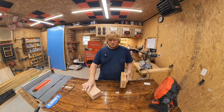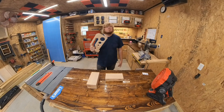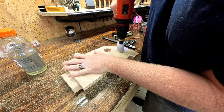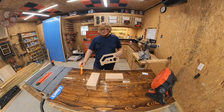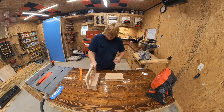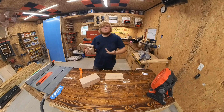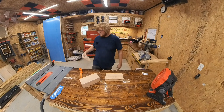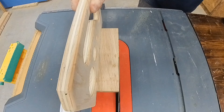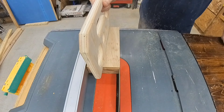All in all, got two blocks of wood glued up. This morning I also made a mock of my push stick. This is the push stick I actually like to use — with this one you have down pressure to hold the front down so it doesn't kick up from the saw. I set the table saw to take almost an entire blade's width off to start flattening one of the sides, taking a few passes to achieve my goal.